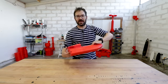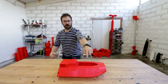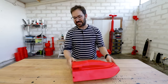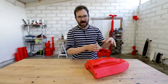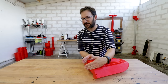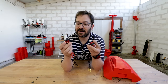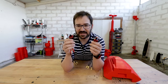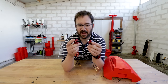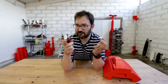The main shape of the boat is going to be this one — it already looks quick — and I have a cover for this. But this isn't going to have a propeller or a ducted fan; it's going to have paddles. The idea is to have two paddles in the back and use differential steering. To drive this we are going to use these two brushless motors that are 920kV, which means they are going to be a little bit more torquey and run a little bit slower, because if we use one of the really quick ones we might make the paddle wheels explode from the centrifugal force.